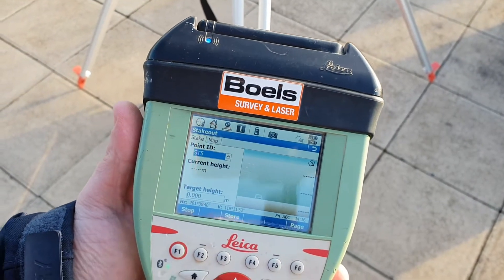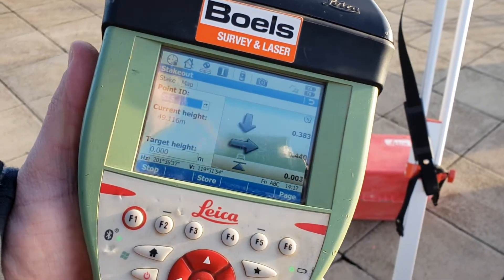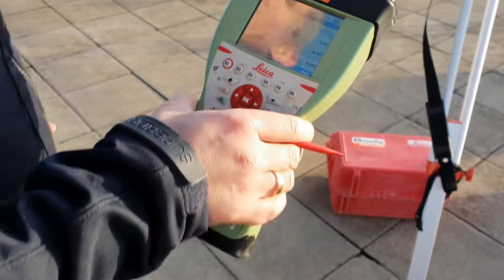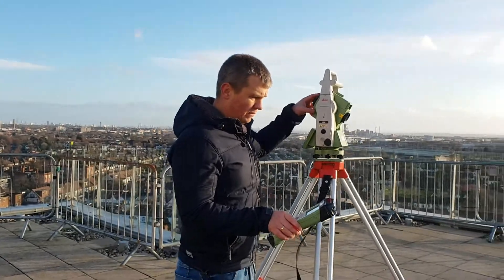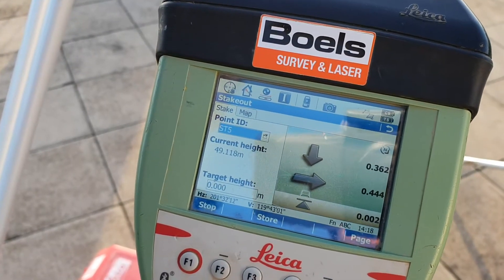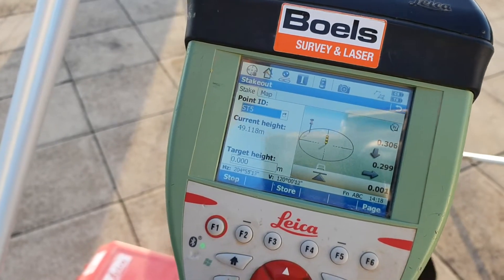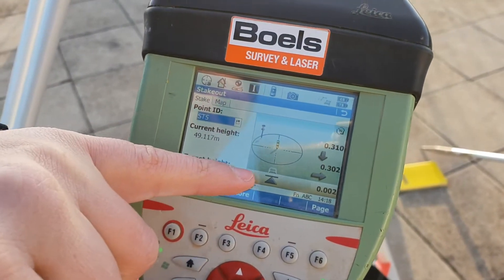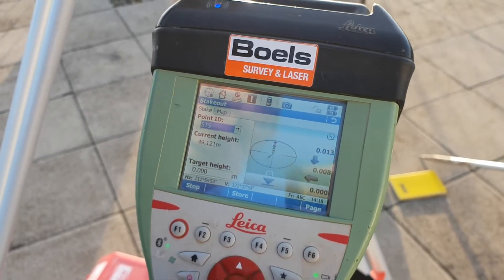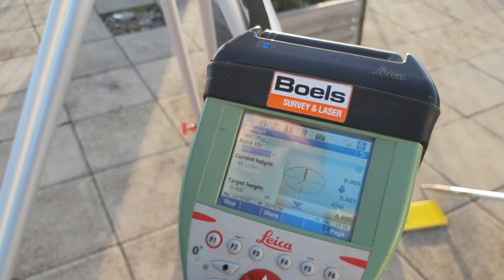I press Distance and start looking for the point. Our point is 380 millimeters from the instrument and 440 to the right. I'm now at 350 and 450 right, so I start manually turning the EDM to get closer. You can see we're now within 300, and the screen is showing the target — now we're just 8 millimeters and 14 millimeters away.